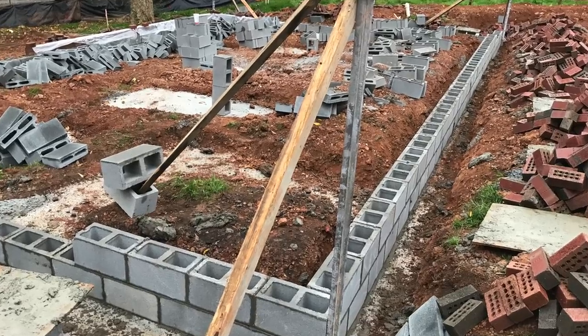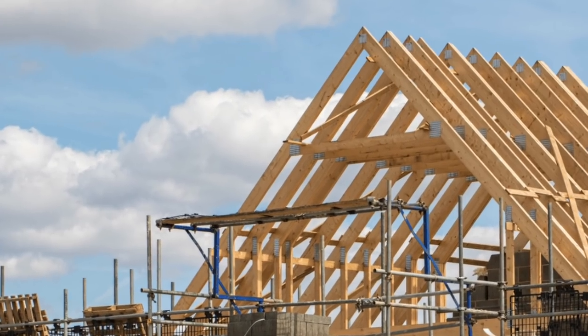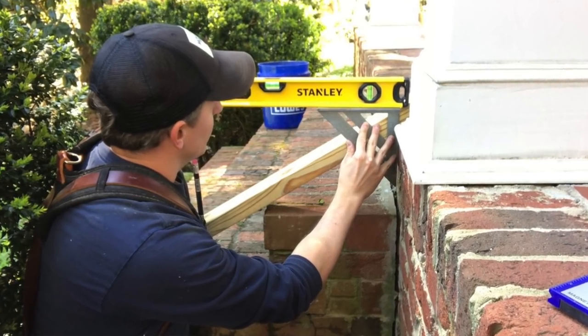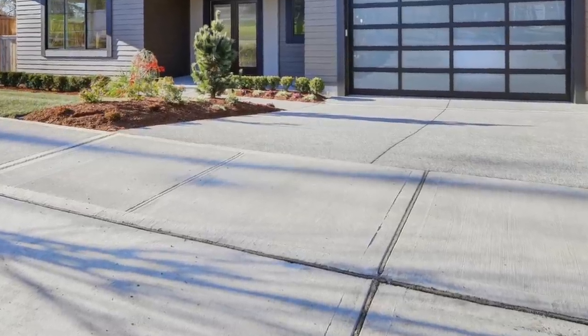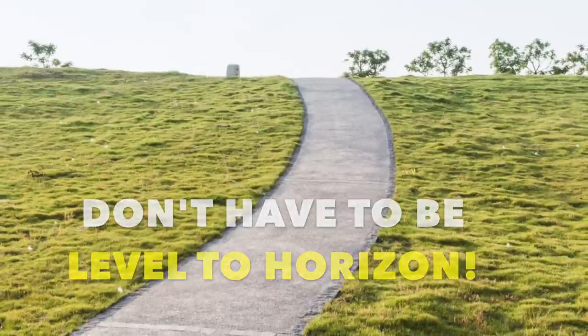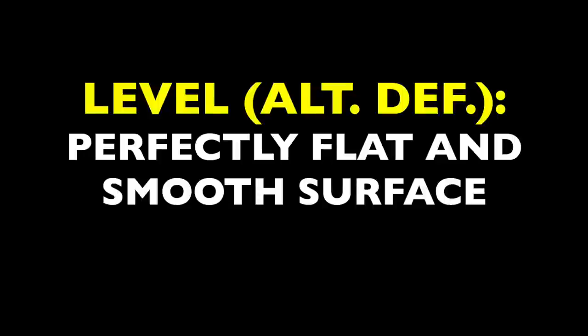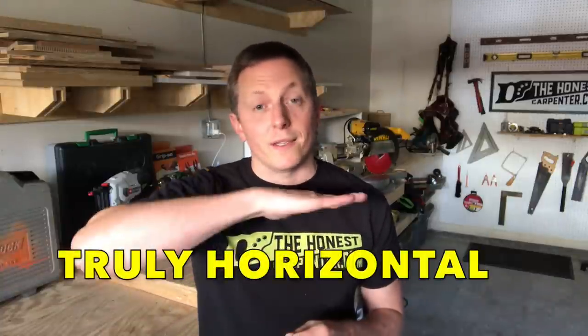Level is utterly important in the foundation building phase — we don't want sloped floors, and all that starts with a good foundation. But we also need to establish true level to set the pitch for intentionally slanted surfaces, like roofs and handrails for stairs. By finding level, we can accurately build things at a certain pitch that is off level. In construction, we also use this term to describe a flat surface with no irregularities. This comes up in concrete work a lot, where they're looking for a level top with no dips or high points. Those surfaces don't have to be level to the horizon — like sloped driveways — they just want to be flat and regular. So we sometimes use level to mean perfectly flat or smooth, but in carpentry and the building of structures, when most people say level, they mean truly horizontal.